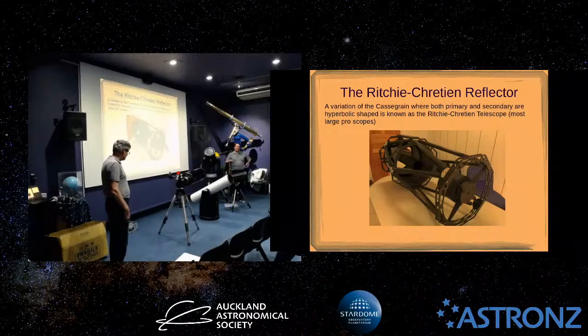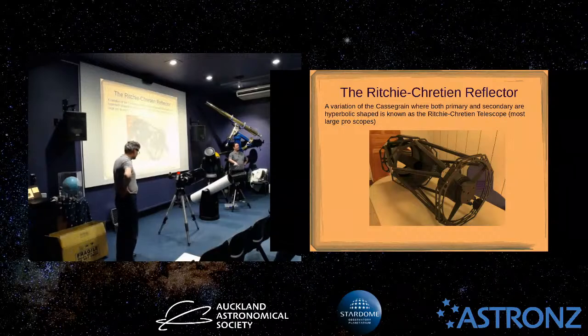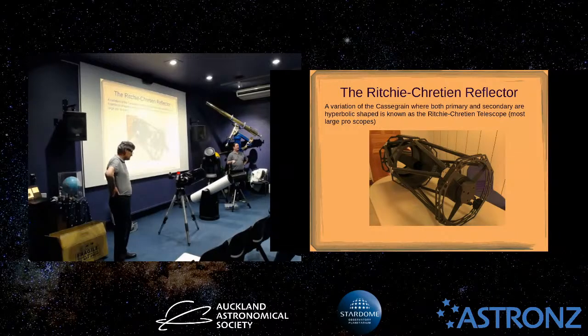It still matters on those, probably. You might get, I don't know, 8 or 10 mil before you start seeing anything bad. With these, really, 1 or 2 mil out and you're starting to see degradation in the image. So that's the distance between the main mirror at the back, the primary mirror, and the secondary, which again is just kind of hidden behind here. Yeah, well, with the hyperbolic mirrors, the alignment is also critical.